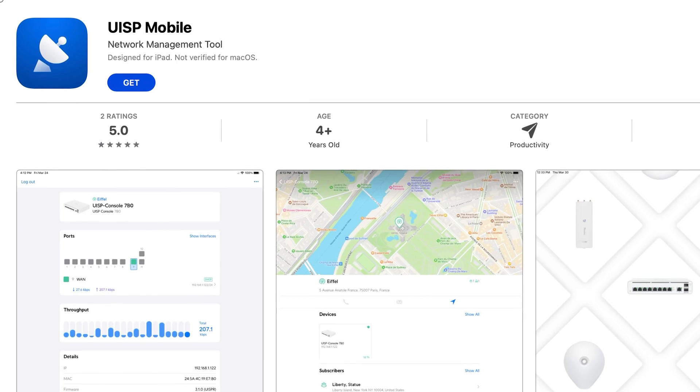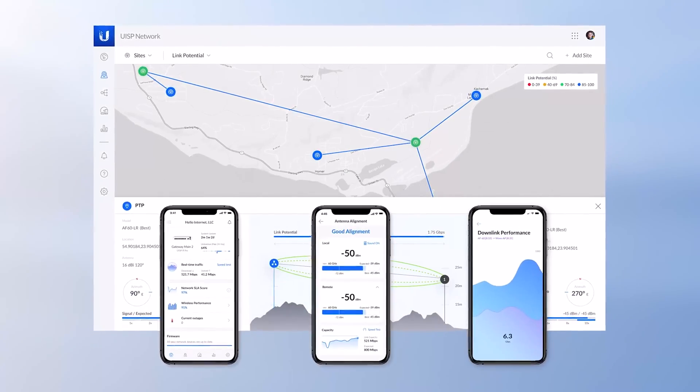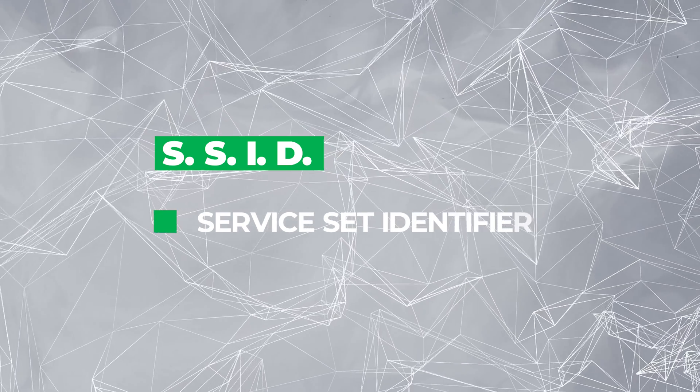Next I went through the adoption process. Each Nanobeam gives off its own Wi-Fi network when you plug it in. You download the UISP app, pull it up on your phone, and connect directly to the device's Wi-Fi. This lets you pre-configure settings and update the firmware. Running a CAT6 cable to my switch and having them pointing at each other, I was able to adopt them via the app and create an SSID — each one acts as a wireless access point connecting to each other. You define the SSID and password on one, and the other connects to that same SSID and password. There's a really good YouTube video I'll link in the description that goes more in-depth about the actual setup process.